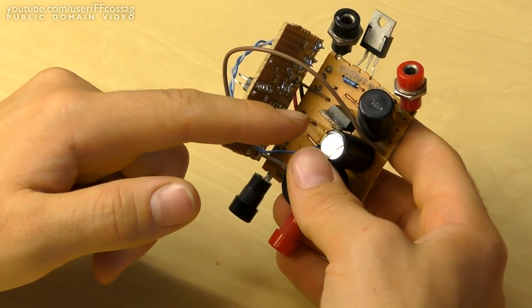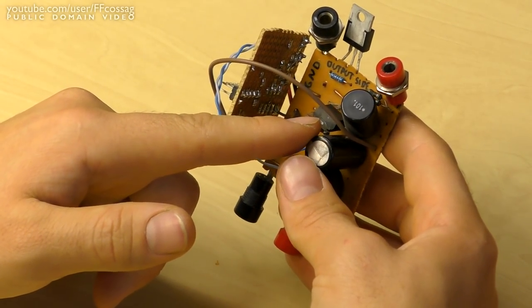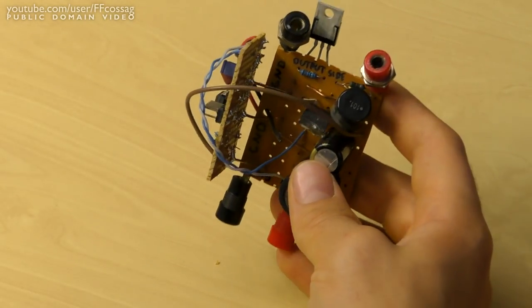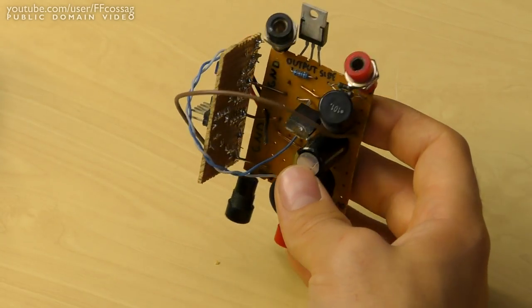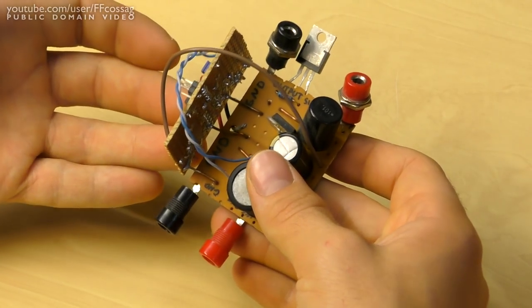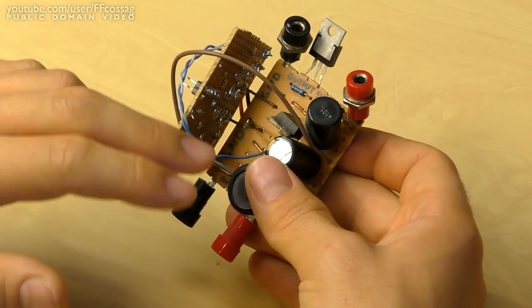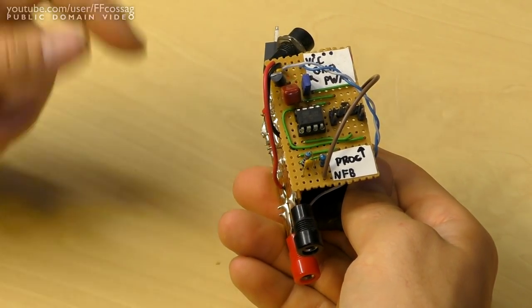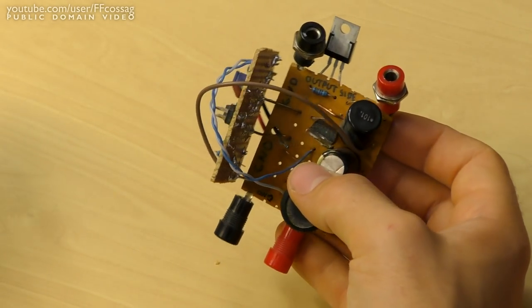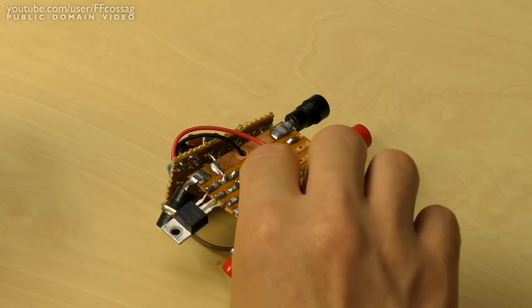So essentially, this diode is the only thing sitting between the huge current pulses and the input of the whole desulfator. So if that goes short, we have a problem on our hands. There isn't really any way for this device to know whether or not the diode's in place, since it's deriving its feedback from a smoothed tap of the output. So it just sees a voltage on the output, and as long as it's what it wants it to be, it's going to keep on pulsing. And well, if it's not what it wants it to be, it's just going to pulse harder.